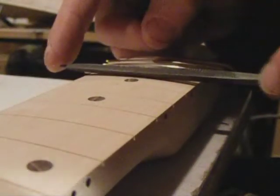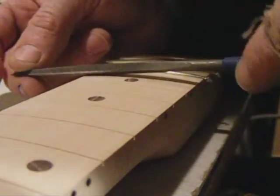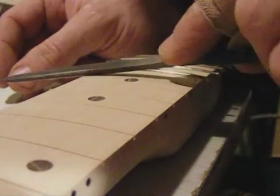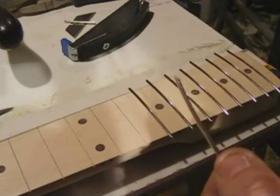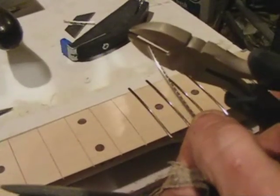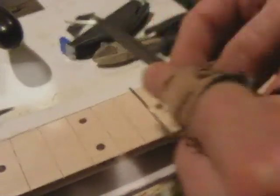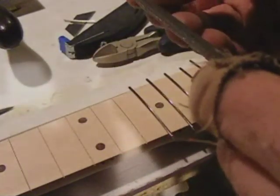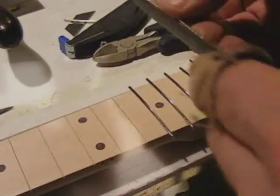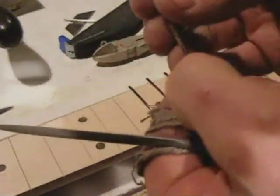What I'm doing here is I'm adding that little bevel with this — actually it's a four-sided file. I'd mentioned I was using a three-sided, but I've gone to this four-sided mini file. I'm just lightly hitting it; it doesn't take much. Then I'll double-check my depth and install my fret. When I cut my fret wire, I cut the piece I need on an angle, because this will be the leading edge of the fret. Then I'll take one of my needle files and ramp it so it's not going to bite into the wood — kind of what they call a ski ramp effect. I'll hit the tang a little bit as well, because it might have spread out a little bit from the nipping.